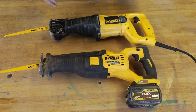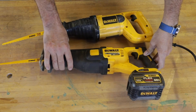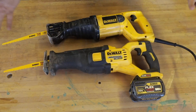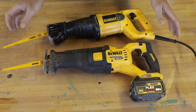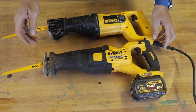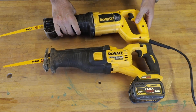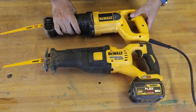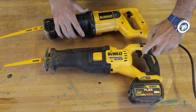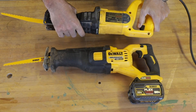The tools are very similar in design and shape. The cordless has the brushless motor with the 60-volt Flexvolt. The main ergonomic differences: the cordless has a bigger handle, better purchase, and a light on it, which I really like. One thing I don't like about the cordless tools is all these safety switches — when you want to use it in an awkward position, dealing with the safety switch is annoying. I really liked that the older tools didn't have that.